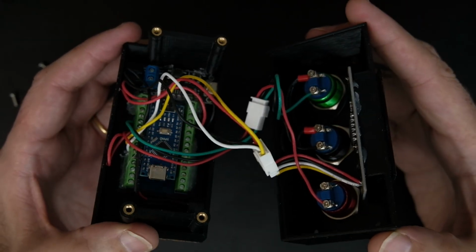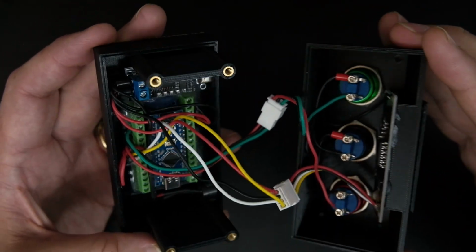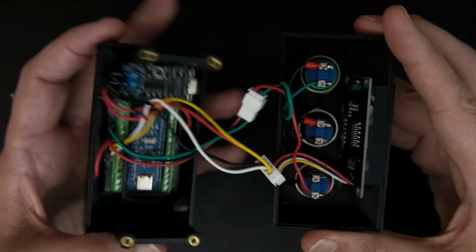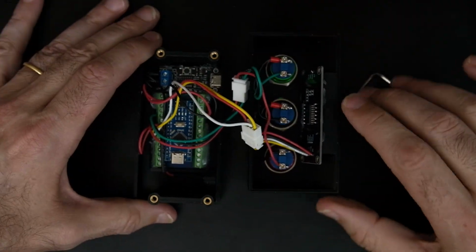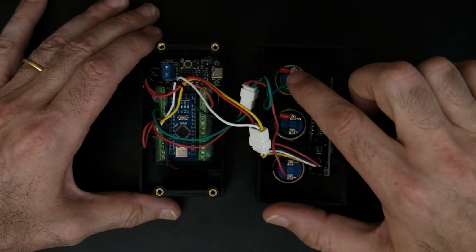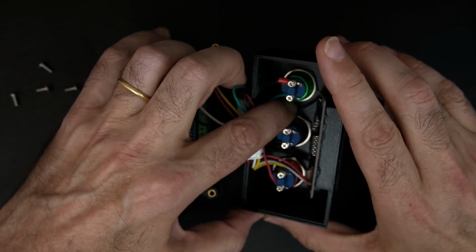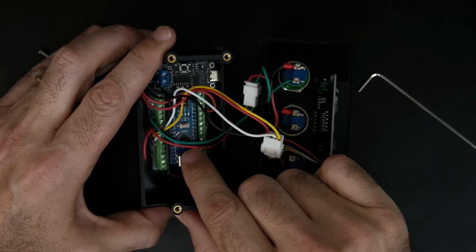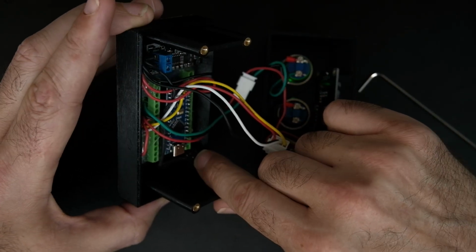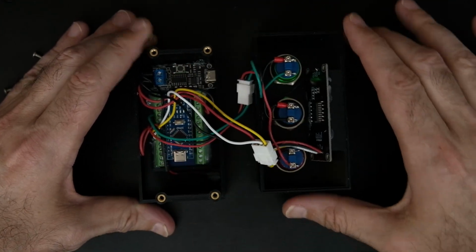I put a little bit of extra effort into this one, and I use these nice connectors so that it looks elegant. You don't need to do that. You can just do point-to-point wiring. You see the display on this side. Those are the 3 buttons held in place with the nuts that come on them. And we have the Arduino in its socket. Tucked down in this corner is the little speaker, and then over here is that USB trigger module.